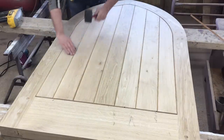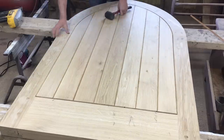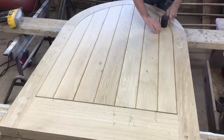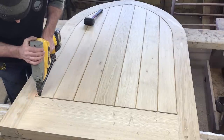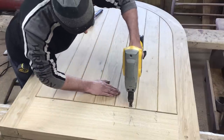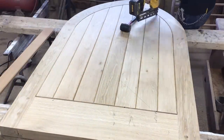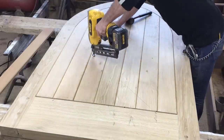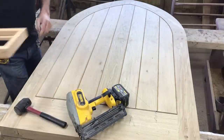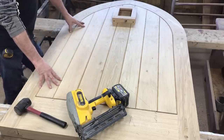Try and even out the joints a bit, because I tend to have sheeting loose. I find inch wood is usually drier than 3 inch, and it tends to swell. So I like to put it in not too loose, but certainly not tight. I'll cut that out now and I'll get it in flush, and I'll come back to you then.